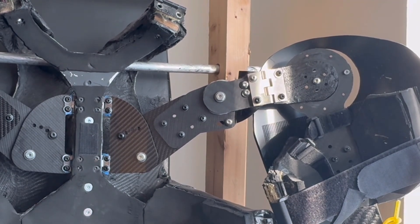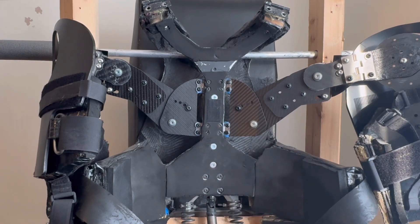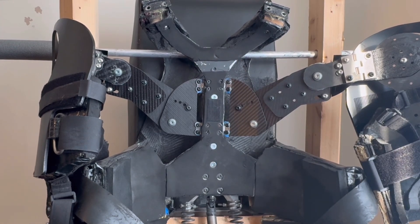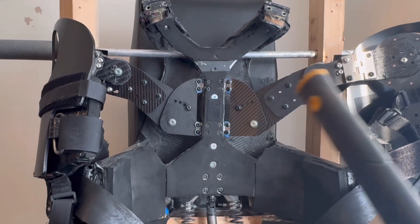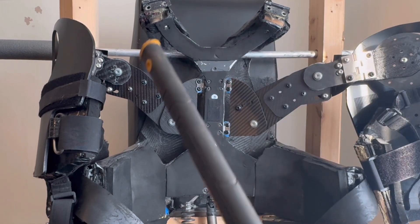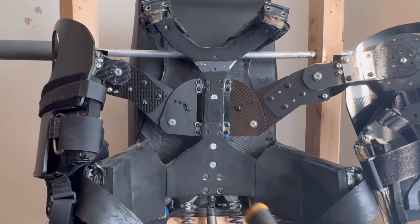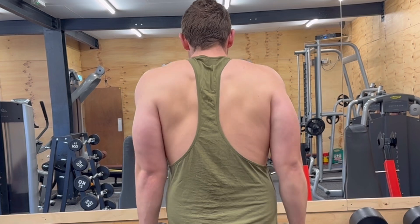I want to demonstrate a problem I found. A mistake I made is that these pivot points here should be lower down, but because I was modifying from the previous design I couldn't move them lower. Unfortunately the fixing points for these parts had to be where they are. The issue is just how you shrug — this is the reason why this next prototype isn't going to be made out of carbon fiber, because I'm having to alter quite a bit and I fear I might get it wrong. Due to the size of this whole plate, making it out of carbon fiber is quite a big piece to waste if I screw it up.